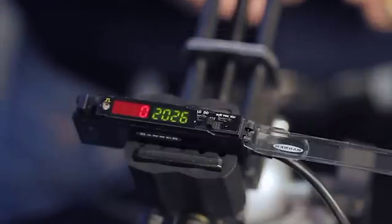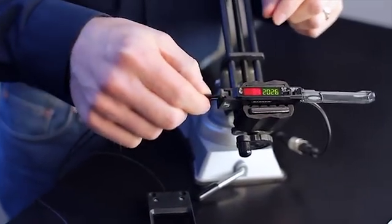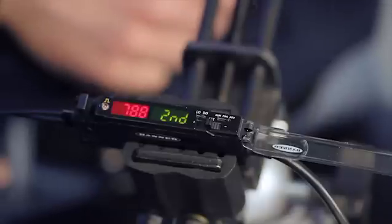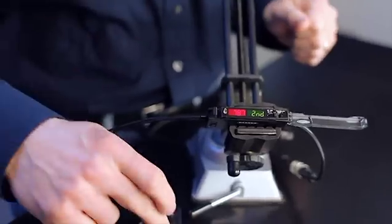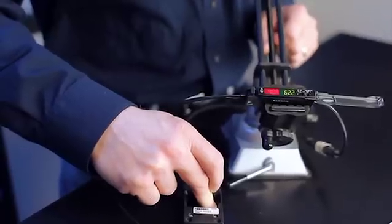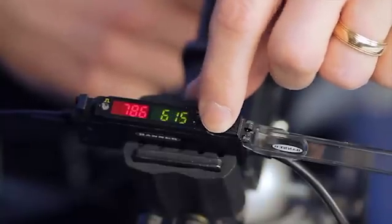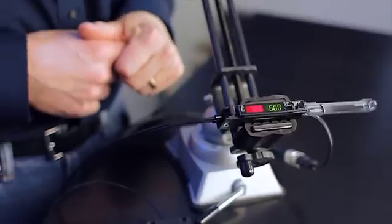Next, I will demonstrate a two-point teach using a through-beam fiber optic array. The new lever-action fiber clamp securely holds the fibers in place. While in adjustment mode, a single press on the rocker button initiates the two-point teach. The sensor is now displaying the current signal value in red and prompting for the second condition and a second button press. A successful teach displays the word 'pass' and the minimum signal difference seen by the sensor. At this point, we can use the rocker button to manually trim the threshold to a nominal value as required. The blinking 600 indicates that the new threshold has been accepted by the sensor.